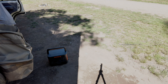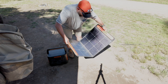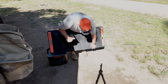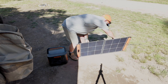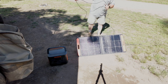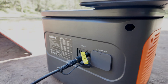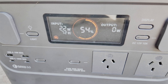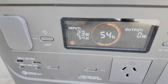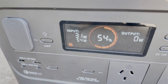The solar panels that Jackery make are really well built — you can just see the quality in these things. This is a 100-watt panel. On the back of the panel it's got velcro stands so you open these up and it'll just stand the panels up. Keep in mind this unit will take six of these. We put that there in the sun; on the back of the unit there's a pouch, and in that pouch is a hardwired cable. We plug this directly into the DC outlet and that is now charging. The display on the front is very intuitive — it's got 54% battery life at the moment, and on the left-hand side you can see the input: 23 to 26 watts coming from that solar panel. If it were brighter it would be charging at a higher rate obviously.